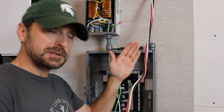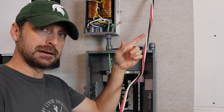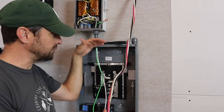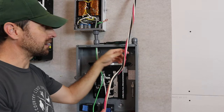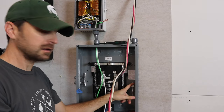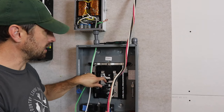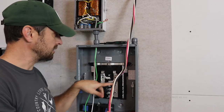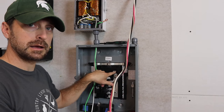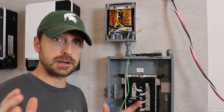You don't really need the knife switch — it's just an added extra barrier of safety because we do have that interlock kit on the main panel. So from our knife switch, or safety switch as they're called, to our sub panel, we've got our four conductors. We've got our ground going to the side, our neutral to the top of the bar, and then our two hots — because it's 240V — on either one of the lugs on each side. Red and black.